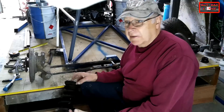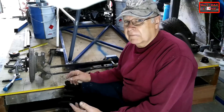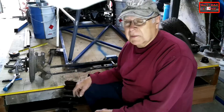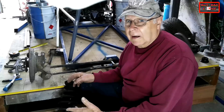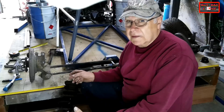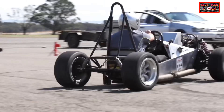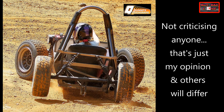What you do with your rear suspension on a special like this will probably be chiefly determined by the rear suspension that was in your donor car. You've either got the option of using what's on your donor car, or if you're not happy with what's there, getting something from the back of another car. Some guys just use straight tube axles or even box trailer axles, and although the handling of the rear of a motor car especially is not critical, I think they are limited in what they can deliver.